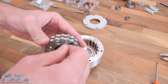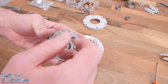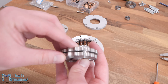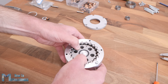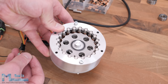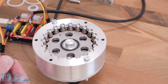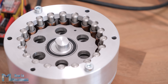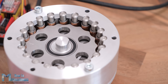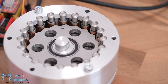When inserting the two discs into the housing, they must be placed 180 degrees out of phase. There's a hole in the discs which can be used for positioning them correctly — flip one disc and align the two holes together. Once inserted, we can power up the motor and see how the discs work in combination with the eccentric bearing and the ring gear rollers. The cycloidal discs rotate with eccentric motion opposite to the input shaft and at 19 times slower speed.